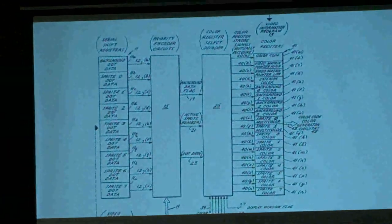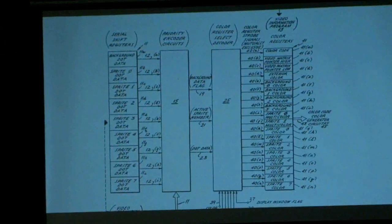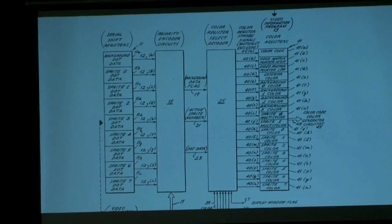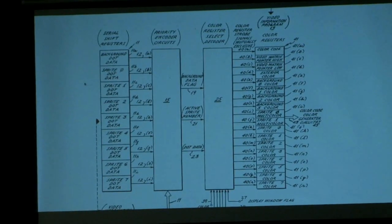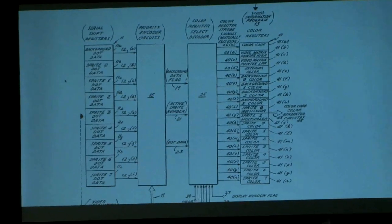Well, this number of 8 sprites on a line, which is a very, very fixed hardware restriction, is kind of at the heart of the chip in many respects, right? So you've actually got a patent on this, and this was the least technical diagram that it had. It also had things with MOSFETs on them. But this whole thing, if I understand, is making the decision of, okay, I'm at a pixel, which of the 8 sprites is visible, or is the background?